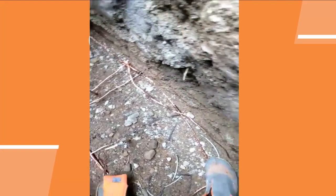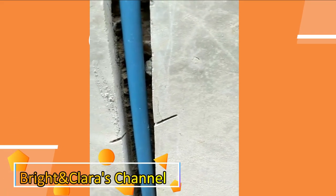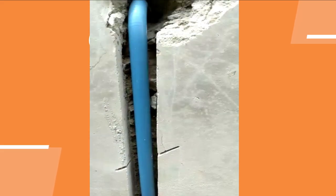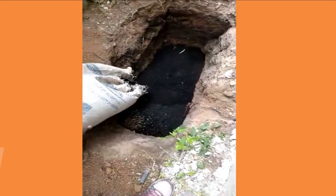He and his boys did an amazing job. When they get to my site they sleep there and make sure everything is done — three days, four days, they sleep at the site and finish everything. That cable is going straight to the distribution board. They will join one cable from the earth rod which will go straight to the distribution board, so that when there is over-current, fluctuation, power surging, over-voltage, or under-voltage — whatever the circumstances may be — that current is not supposed to stay in the system; it will go to the general mass of earth via the earth rod.